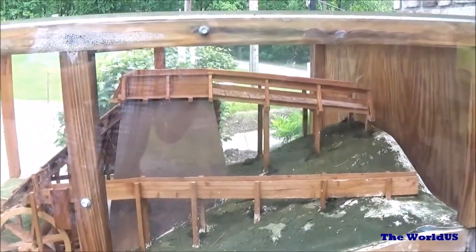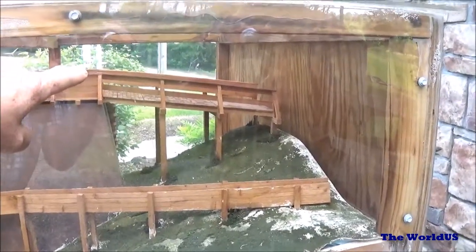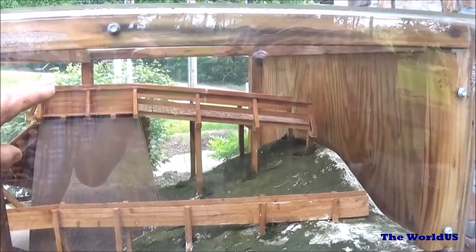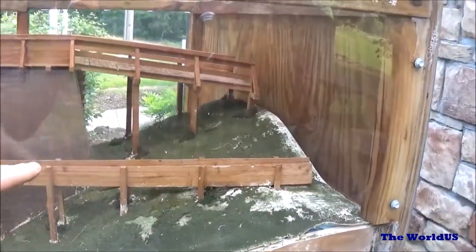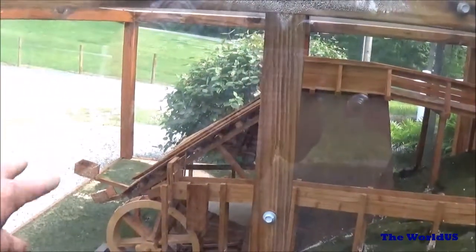This is a diorama of what the cast-iron furnace would look like. Up on top we have the charging platform — that's where the iron ore would come up with the charcoal and the limestone, and this would be where they would actually pour everything into the hole. Down here is the water going on the water wheel, which would move the bellows up and down. The bellows would be blowing air into one of the openings in the furnace, and that oxygen would create a very high heat that would melt the cast-iron.